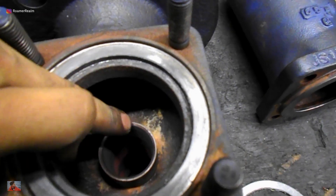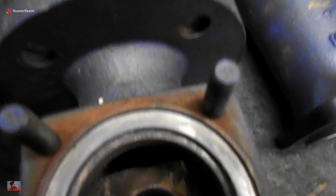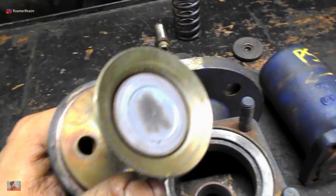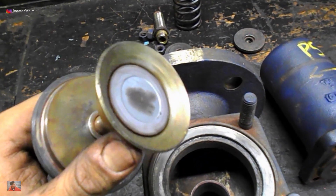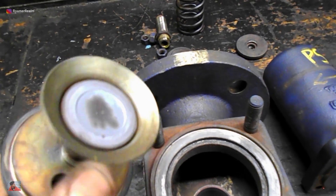Depending on your previous work experience, you can use the surface of your fingernail or the tip of the finger to feel the surface to determine the presence of any surface defects or fine cracks. The corresponding mating surface of the valve disc should be carefully examined as well.